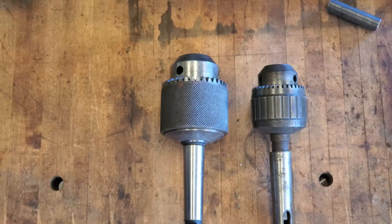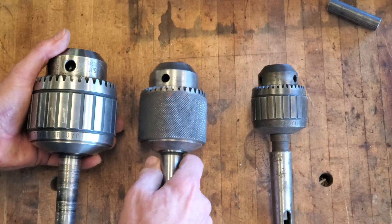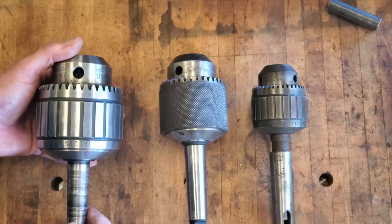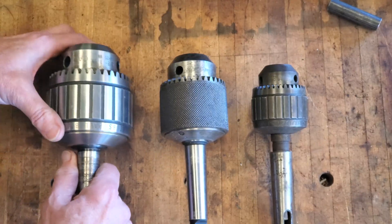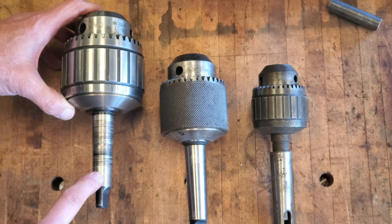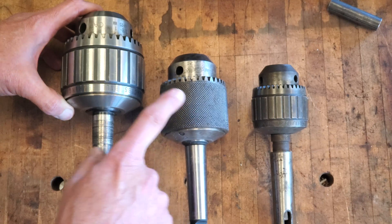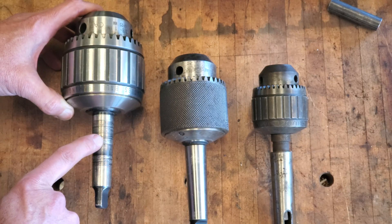So that's my three-quarter inch, which is a number 18. We've got a 14 and an 18. And this is the Jacobs 20N, three-eighths to one-inch super chuck — one massive chuck. You can see that this arbor is really beat, and in my opinion it's too small of an arbor to run this chuck the way it should be run. So this smaller one will be used in the Akriturn lathe, and the 20N is going to be used in the Monarch lathe, but I have to get this Morse taper arbor out of it.